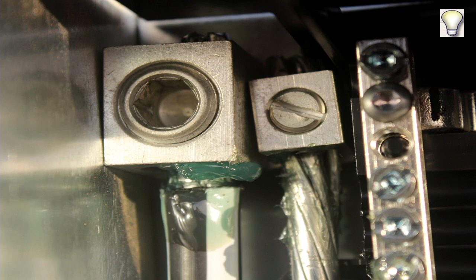Now, if the manufacturer of the aluminum wiring says that you shall use some kind of an inhibitor at the termination, then you would be required to do that. So it's not a requirement unless the manufacturer requires it. And to my knowledge, the manufacturer doesn't require it.